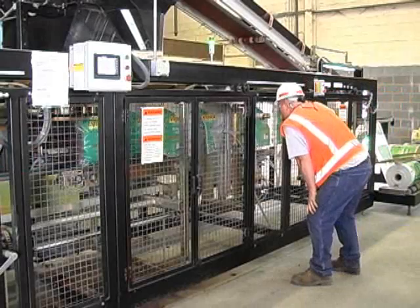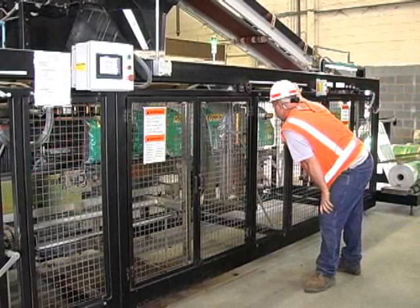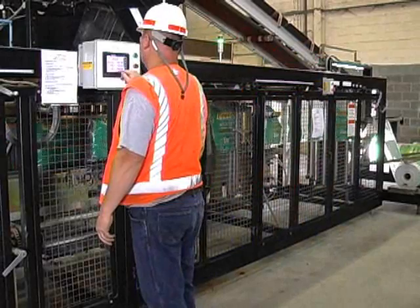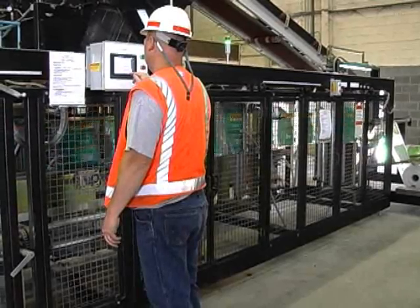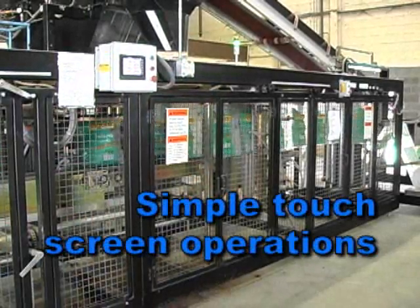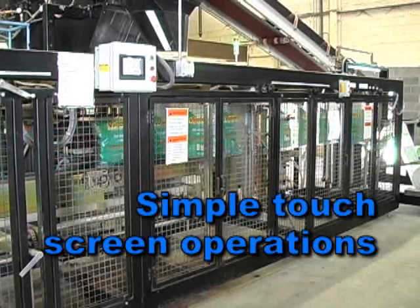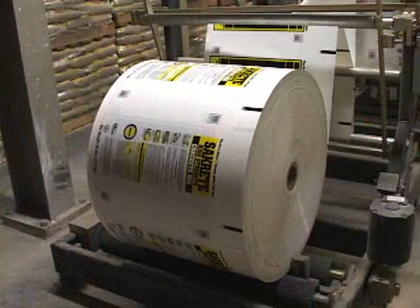All Hamer form, fill and seal machines are built with the same engineering guidelines, keeping them simple to operate and maintain. The majority of machine controls are mechanical, with adjustments for bag conveyors, side weld, jaw assembly and others mounted on the outside of the machine for fast access. Simple mechanical knobs are connected to inverted rack and pinion adjustments. Settings are scaled to ease repeatability. A simple touch screen is provided for setting times of machine performance, feed discharge or seal dwell, and for operating options such as handles, mitered corner seals, shaker chutes or others.